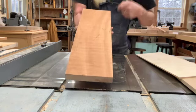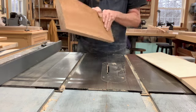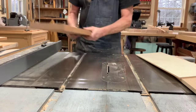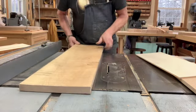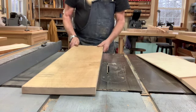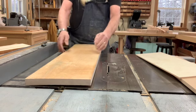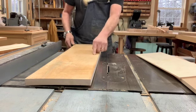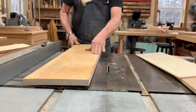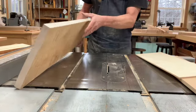So what do I do? I take this to the jointer and I smooth that surface and then re-straighten that edge to make sure it's nice and square. I did a jointer presentation a couple of videos back — you may want to check that out. Here's a worst case yet — look at this. It rocks so badly that there's no way that's going to be safe. It's going to rotate, dig into that blade somewhere, and kick back. Even flipping it over — the board is in wind, still extremely dangerous. So please don't do this. You won't get away with it.